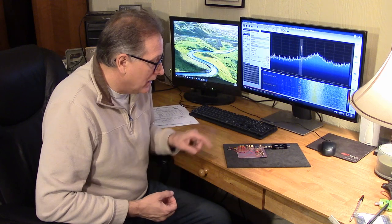Once you start to get above 10 or 11 megahertz, the noise does begin to come up, and you would like to have some better noise figure, some amplification in the system. So I'm going to go on with that in the next video. But I did want to show you what a basic passive upconverter performs like in this video.